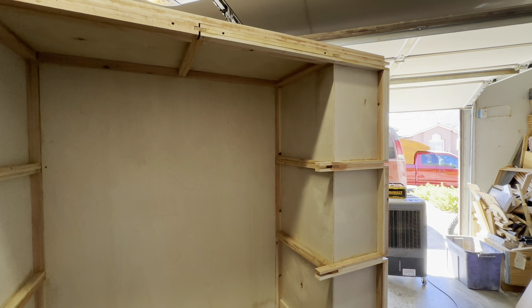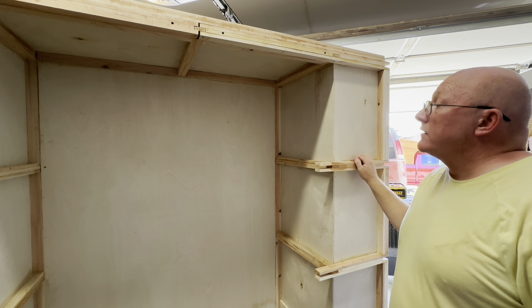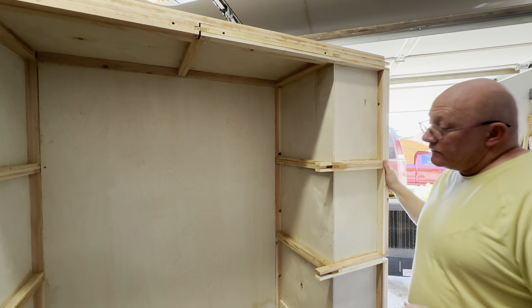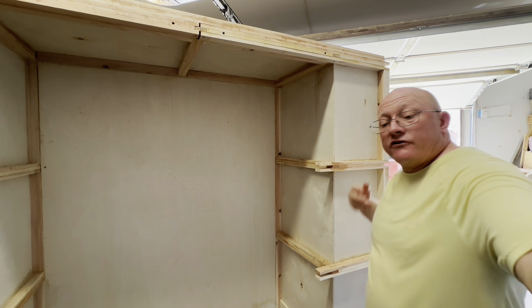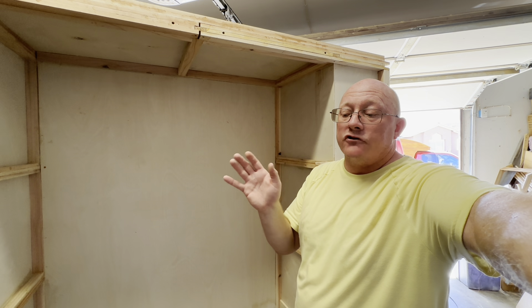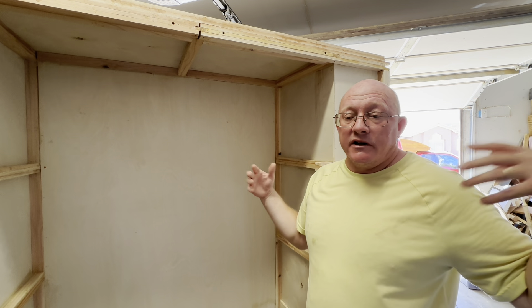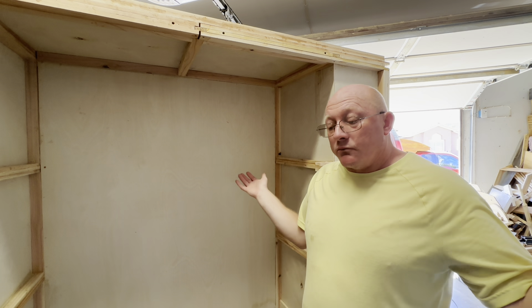So at this stage of the build, I will go over the exterior surfaces of the tub, give it a nice sanding, fill in the various screw holes and indentations left by the quarter-inch staples, and then put the Durabak coating on. In a nutshell, that's where I'm at. This building technique is very strong, and like I said — 68 pounds, a pretty darn light tub structure. Thanks guys for watching. If you have any questions let me know, and I'll see you in the next video. The lives I'll do during the week I'll just turn on the camera in the shop while I'm doing some work. If you have comments or questions you can post them and I'll try to occasionally look and answer those. Some people just like watching somebody working in the garage.